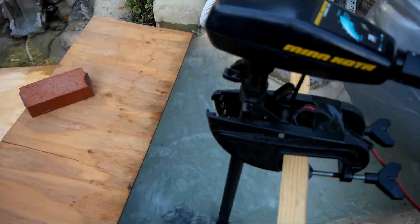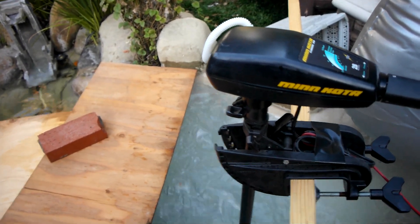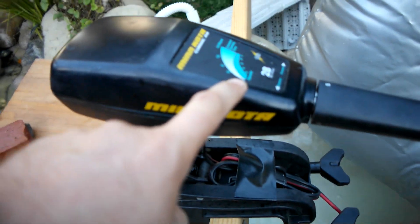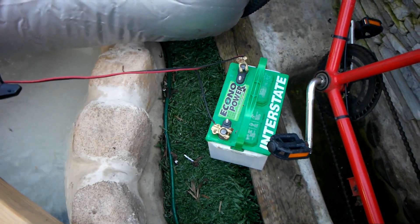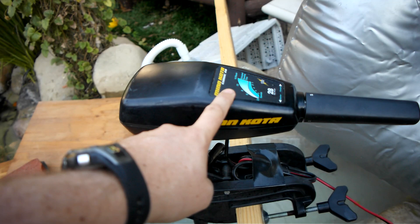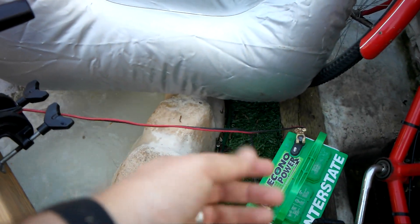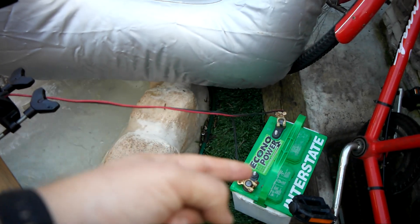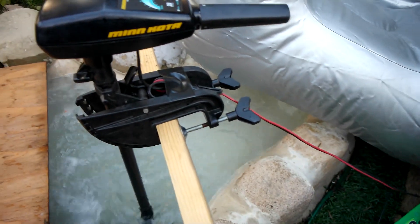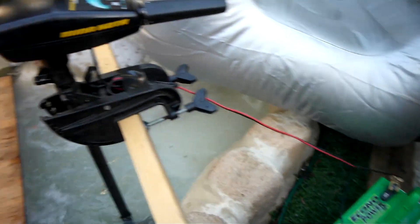This is a Minn Kota Classic 28. I think 28 indicates the amount of pounds — they measure it in pounds of thrust. It does have a gauge on here, which is interesting. On Power 5, which we're on right now, it indicates they'll go 2.5 hours. What's deceiving is it doesn't indicate the size of the battery. This happens to be what they call a deep cycle battery, which is what they use more commonly in golf carts and such. I don't know if this gauge is based on one of those batteries — which I think is encouraged with this sort of motor — or if it's a car battery, which is cold cranking amps. This deep cycle doesn't have too many cold cranking amps because it's not required to start a car. It's used for regular golf carts, driving solar panels, and such. It's made for just a continuous flow, so it should last longer than a car battery, which is focused more on cold cranking amps to start the car in the morning when it's cold.